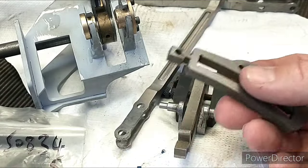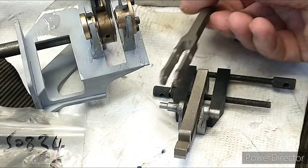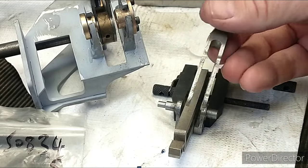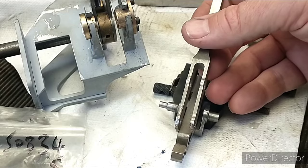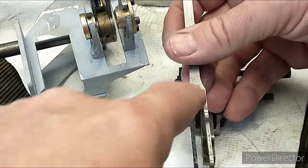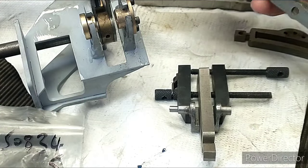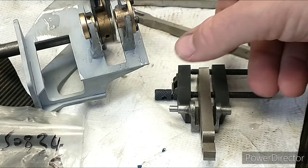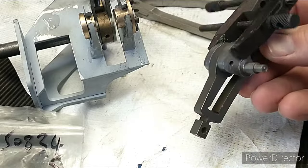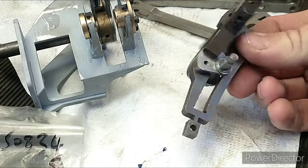These are made to the Spink drawings, so we have a few problems using them on the Model Works kit. The Model Works kit is expecting a six millimetre thick part - this is quarter inch plate - so this should go over this forked section which is six mil, and it's slightly too big by 0.3 to 0.4 of a mil. The other problem is these parts have three holes in them and the corresponding parts have two holes, so that's something else we need to fix.